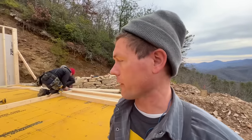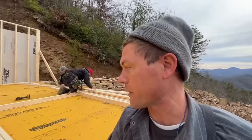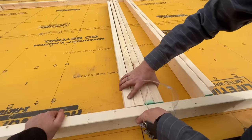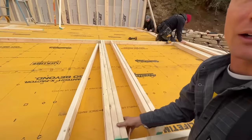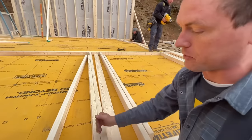We pretty much like to get all of our framing members laid into place based on the layout. This one here, we've got a pack-out of four members. If I just went ahead and nailed all the ends on, I wouldn't be able to nail each member to the next in the middle. So we have to remove the outside ones or start from one side and work across so that each member is nailed to the next one.